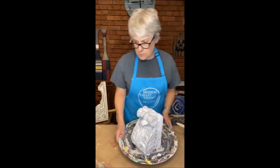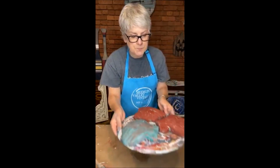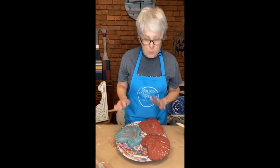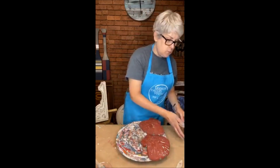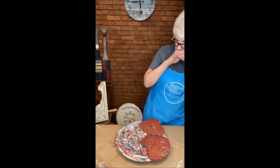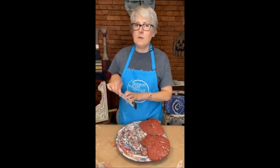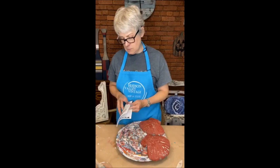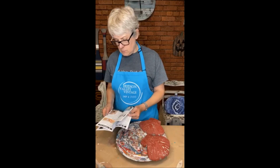Okay, let's put this over here. So these are dry now. And we have a lot of crackling going on, which is very cool. Now, if you don't want crackling with your milk paint, we have a product. Well, I hit it with heat, so I think if you let it air dry, you're not... I could see it as I was hitting it with high heat, it was crackling, and I could actually really force this milk paint to crackle, which is really kind of cool.